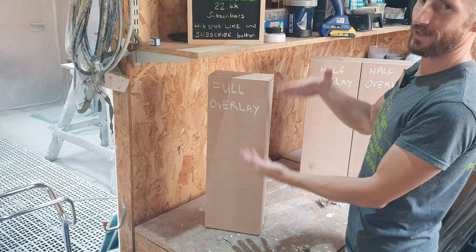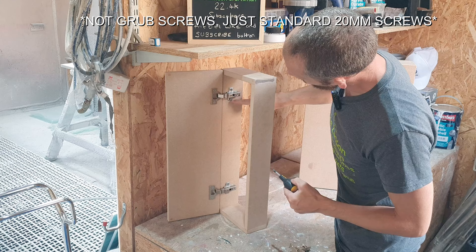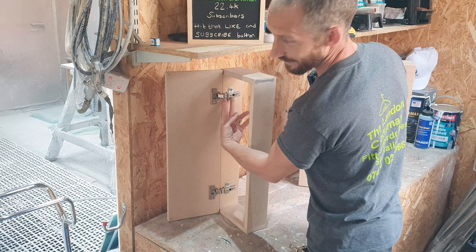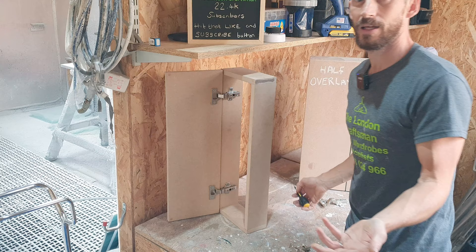For adjustment - let's run over that quickly. If your door needs to be lifted up or down in height, release the grub screws holding the plate onto the carcass - just a half turn on each. Get someone to lift the door for you, or you can lift it yourself or push up on the hinge. You'll see there's a slotted hole showing how much adjustment you have - tighten those screws back up and that's how you adjust the height.